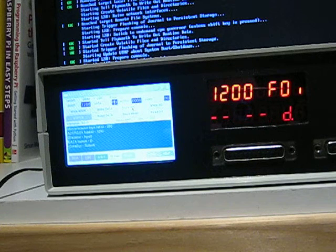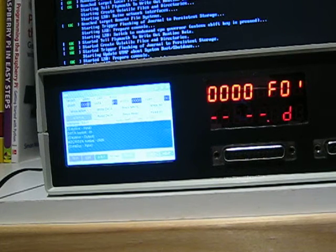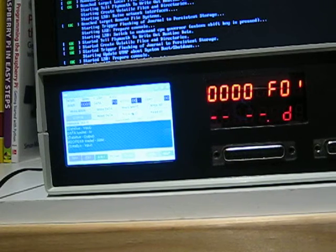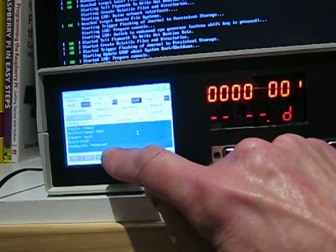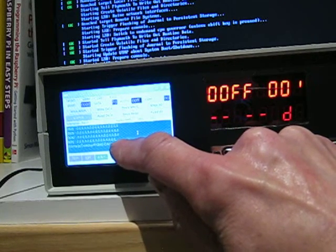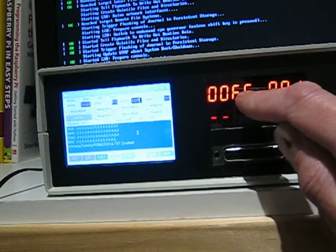Bytes, that's to do with the block read and block write. So for example, if you want to set the address to 0000, so we'll go back to that. So we do our write address, you can see it changes to 0. Ignore the data and say we want to read in, say, FF for bytes, right? So we want to block read that amount of data. So you do block read, and what will happen is it says reading data, please wait, and after a short while it will come up with information, and the display will indicate the next address the tester will go to.